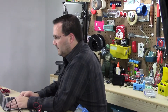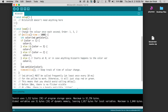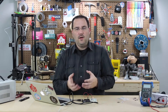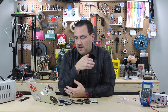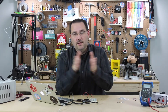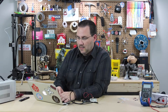If we take a look at the code, it's pretty simple. It keeps track of some time, and depending on how much time has gone by, it makes the LED color one, two, or three. The code is essentially saying a bicolor LED, which has two colors, really has three. And in all actuality, it does — if you had a red and blue bicolor LED, you could make red and blue show at the same time and get purple. Pretty clever code. It's a nice library and very simple to implement.